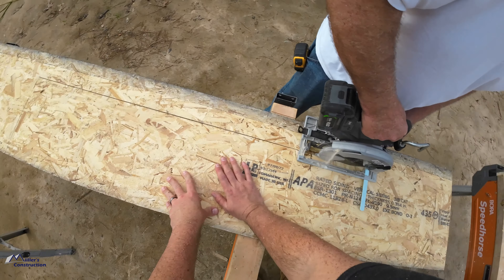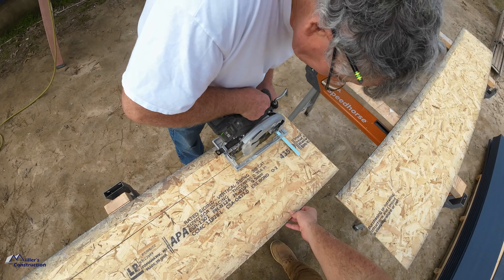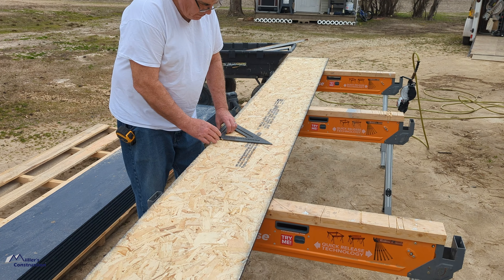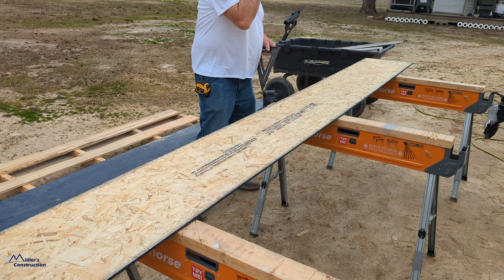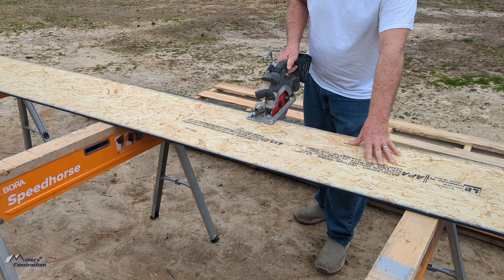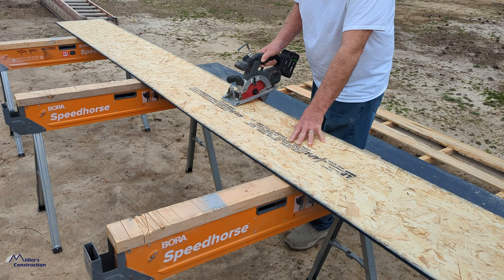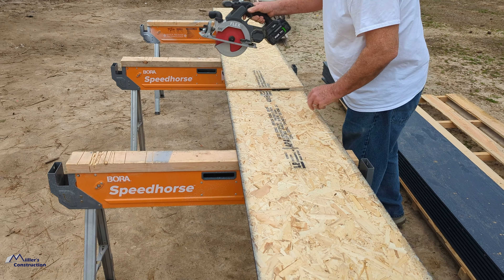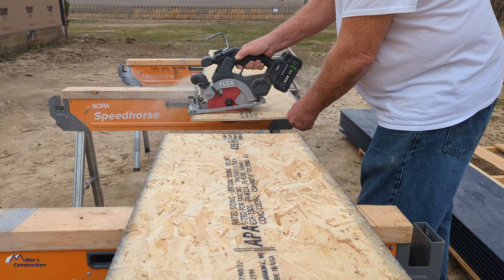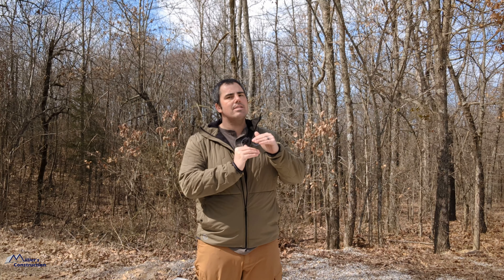It's not a good look down the road, especially when that sealant starts collecting dust or debris before you pressure wash it. I like to tape both sides, tool off the sealant with a putty knife, and pull the tape — you end up with a perfect joint. It doesn't take that much longer once you get used to it. We've done every house like that, and we've gotten so efficient at it. Use Sashco sealants on your LP SmartSide install — I can't recommend these products enough.